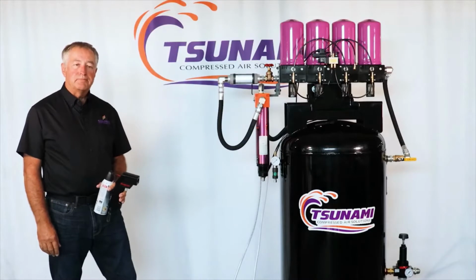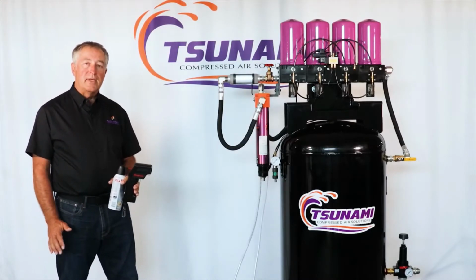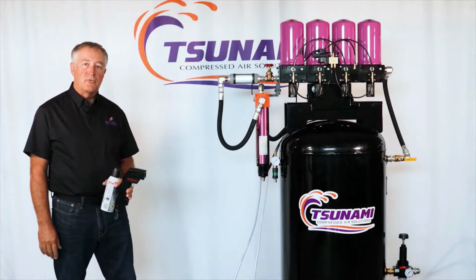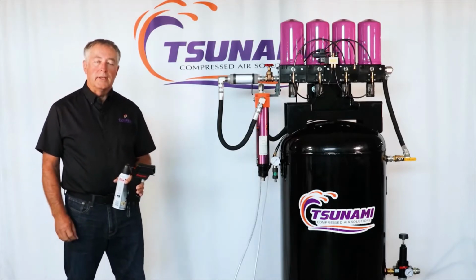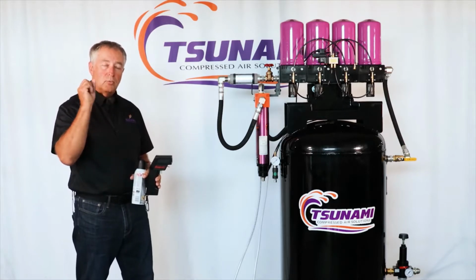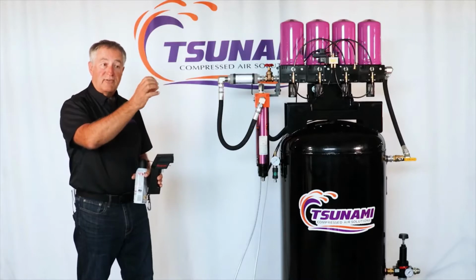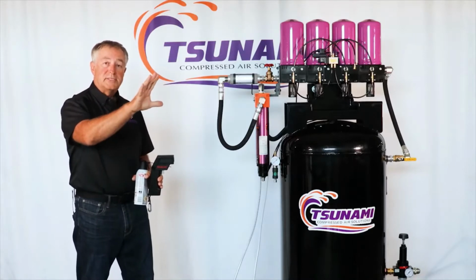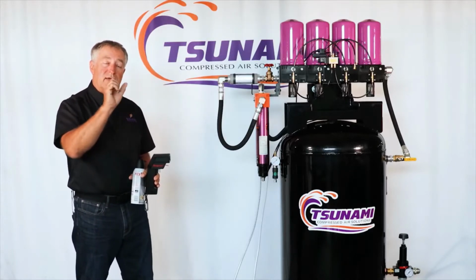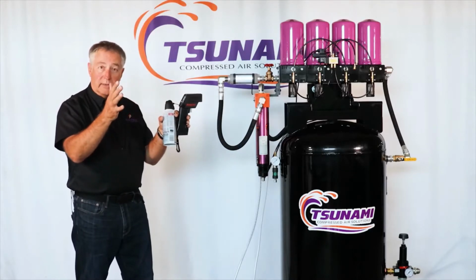Brad from Tsunami. Going to take a few minutes and talk about supercooling and how that relates to dust collector performance. What is supercooling? Supercooling is when you have compressed air at a certain pressure, and when it runs through your high flow valves, your dust collector pulse jet valves, you have a rapid expansion of air. And when you have a rapid expansion of air, that creates a cooling effect.